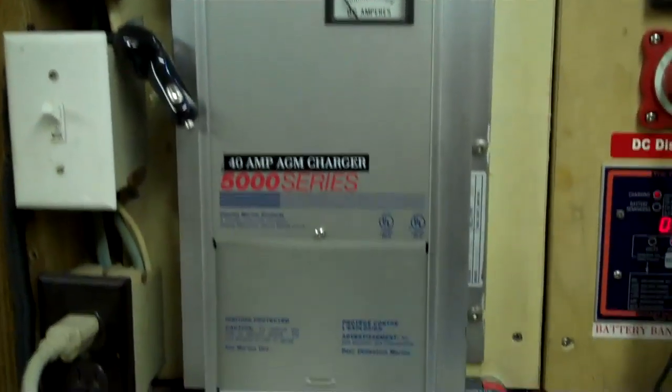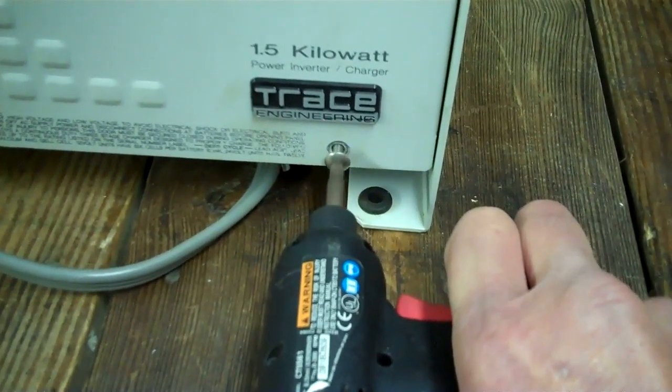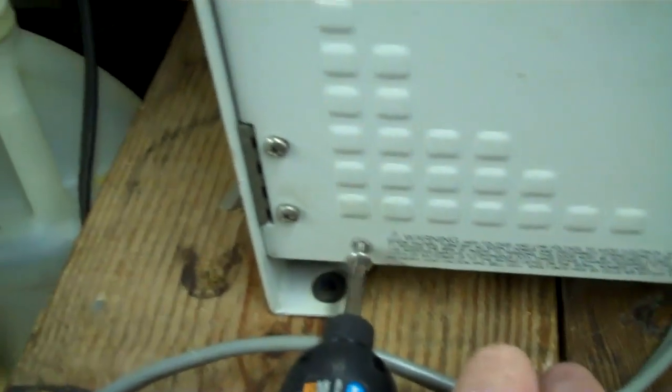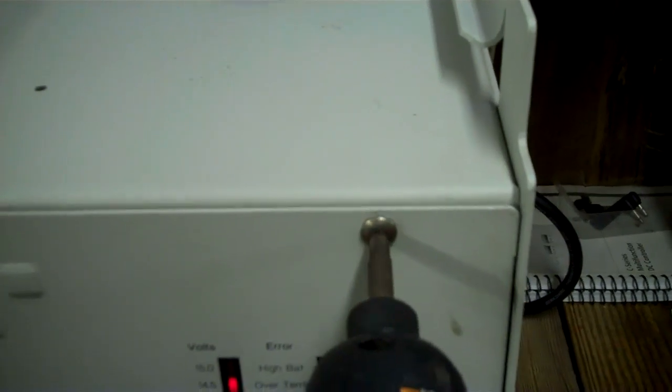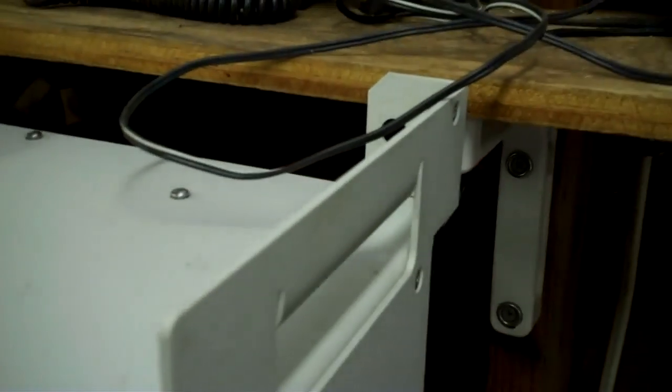I do like the idea of having a pass-through inverter paired up with just a regular old charger. This is going to be one of the most common inverters you can find on the used market, and I'll try to explain how to use it on solar. The only way to really utilize your solar is to adjust your charge parameters down to where your solar panels have something to do, otherwise you'd have to run purely off-grid or have your solar panels doing nothing until it switches over. And that's what a transformer inverter looks like — these things are crazy heavy, that's why they've got basically handles on them.